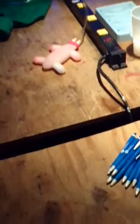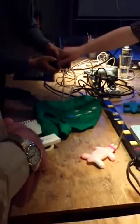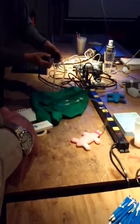So if you want, you can give these a try. Just be very careful not to overinflate it. These are sphygmomanometer pumps. The idea is these valves control whether or not air goes in. They're bleeder valves. All the way to the right is locked, and so you squeeze it, and that puts air in, and then if you twist, it lets the air out.